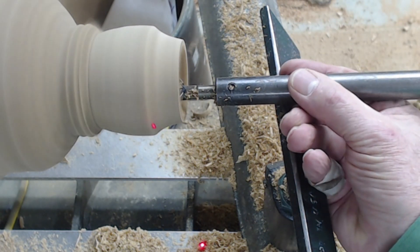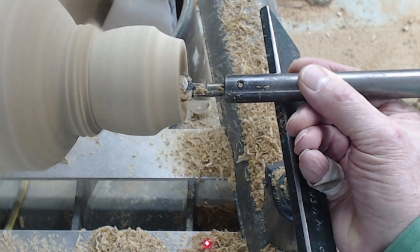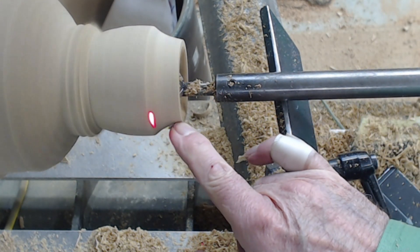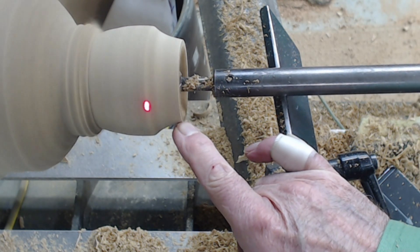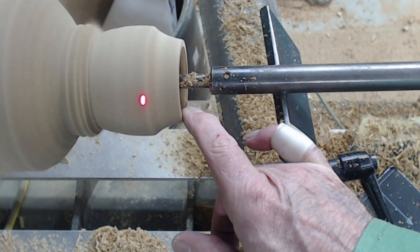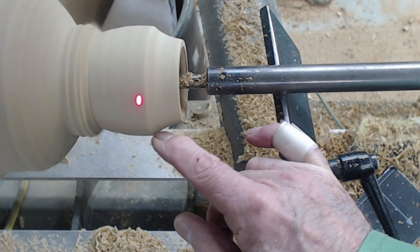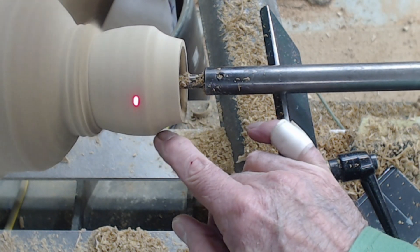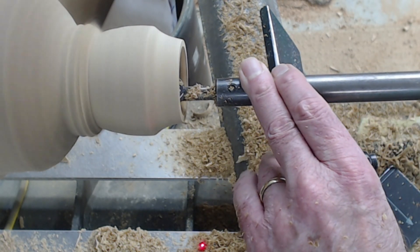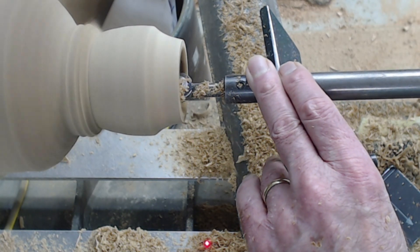Clean up the tool marks. Don't go back. If I didn't say it, I should have said it two or three times: don't go back. This is thin — it's going to start to dry out, it's not going to get round anymore, it's going to start to flex and vibrate. I have to be happy with it before I move on to my next stage. Don't go back. All I'm doing is transitioning it in from stage to stage so that there's no tool marks, and I never really go back out to that top again.